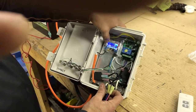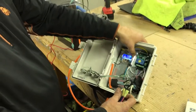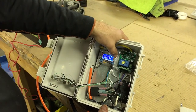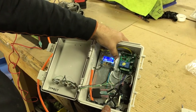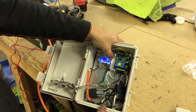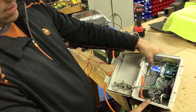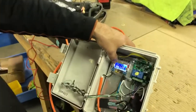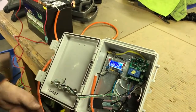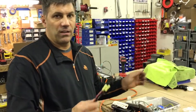By pushing these particular buttons on the side here, you can see I can control the amount of voltage going into the board. So that's 9.9 volts right now — I don't want to be that low because it won't actually activate my relays. I want to be as close to 12 volts as I can. My battery in this case is a little bit low, so I'm only getting 11.3 volts. I'm going to keep pushing the up button until I can get up to 12 volts. It's not doing anything anymore because I don't have more than 11.3 volts in there, so I'll go back down and push the button until I hit around 11.2, then push it up two or three more times to put me around 11.5 volts. Anywhere between 10 and 13 volts is okay on this board, but you want to try to keep it at 12 volts — between 11 and 12 volts is really where you want to be.